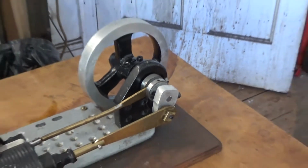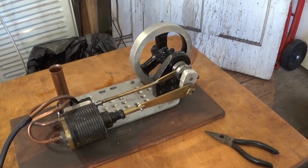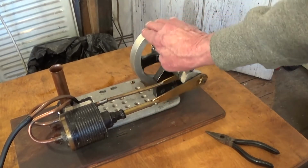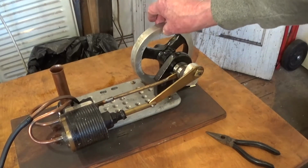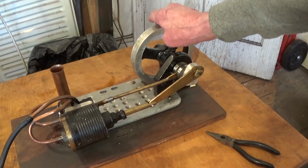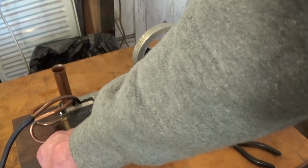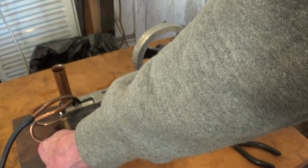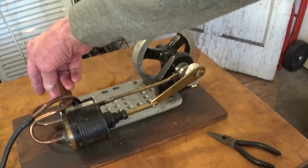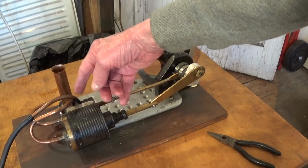The other thing is the piston, that's another Achilles heel it's got, because it's not going to last forever. And it's the spool valve I made, and I got that right with the greatest of difficulty, because of how it works. I've got one pipe going into the cylinder, so that's exhaust and inlet, and what happens is the steam comes in this pipe there, which has got slightly loose, you see, so it'll leak a bit, but that's what you get.